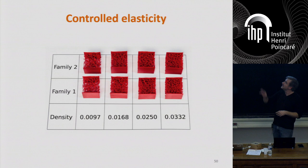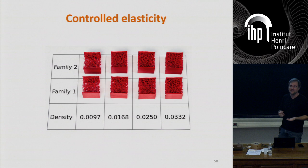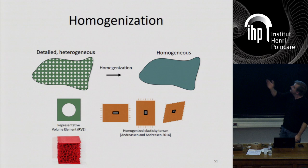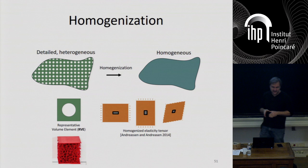That's exactly what we wanted to achieve. It turns out in material science this is fairly well known — they use Voronoi diagrams and open-cell Voronoi diagrams to model existing materials, so there's an interesting connection. Of course, we don't do this with a mechanical machine for the entire space of possibilities — that would be too much work. Instead we use numerical homogenization. Here's the catch: when you do homogenization, you need a representative volume element — we don't have one because our thing is completely random. What we can do is easily generate cubic samples of foam which are periodic — one of the constraints you need to run numerical homogenization.